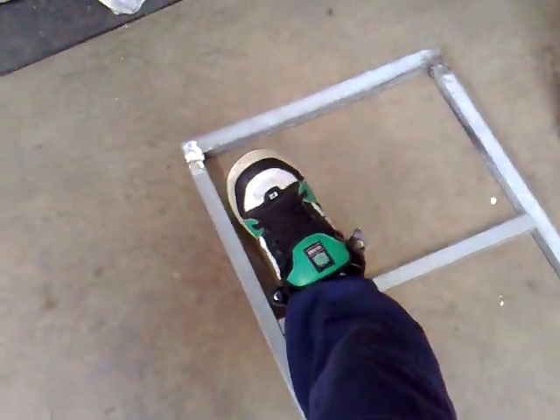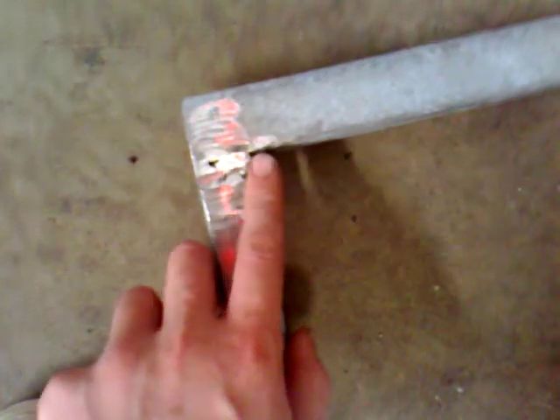Once I have a seat I can sit in there and know where to put my foot, because that's a footrest and the pedals are going to be here. Steering will go down there and I just grinded off these — welded it and then used a grinder to make it all nice. These ones aren't so great. I put a bit of a thicker bar up front and welded it across here and there so if I hit the front it won't crack — it's a bit stronger up front.